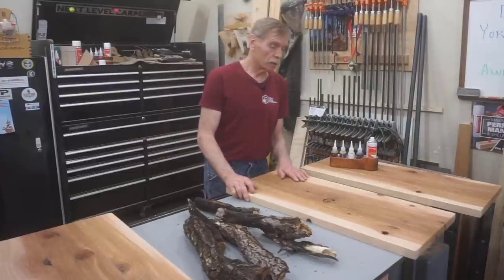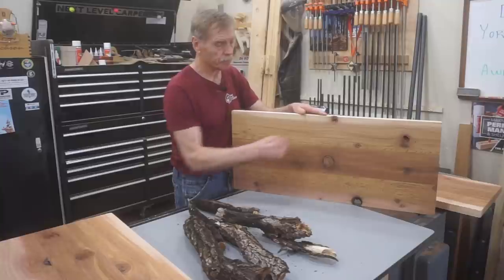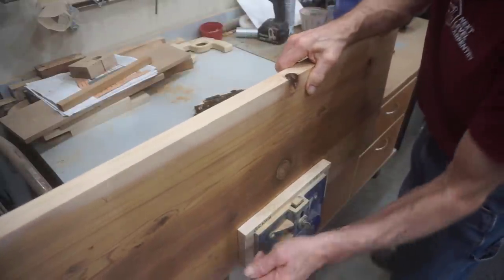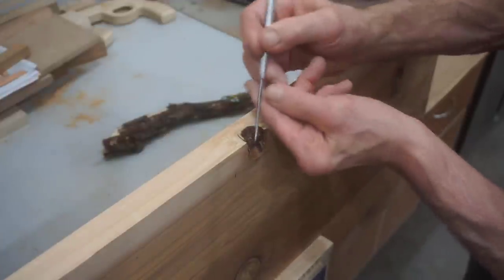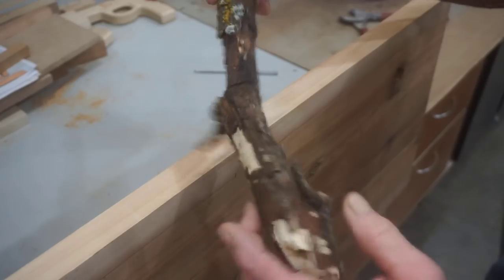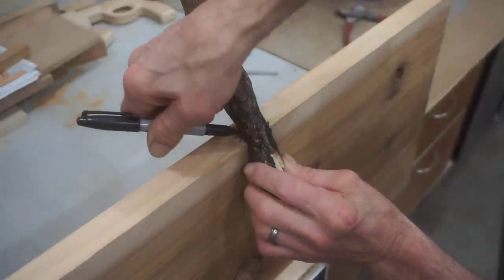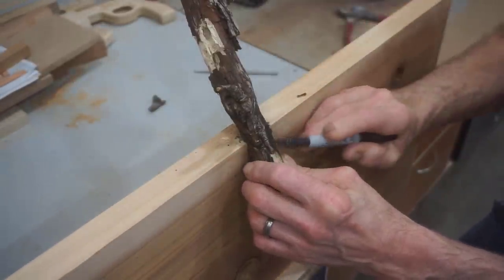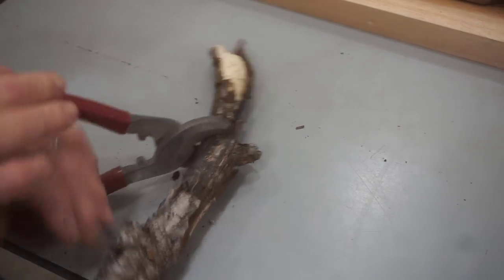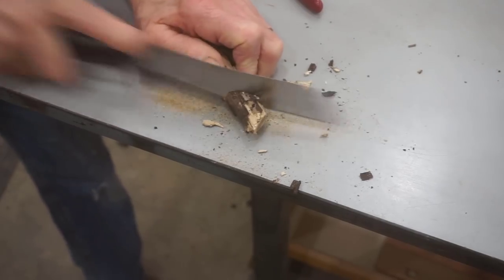With those three key ingredients outlined, I'm going to start with some low-hanging fruit and fix this divot in the corner of this piece. I'll clamp the drawer front in my bench vise so it's secure at a good working height. I use this little angled pick to clean out anything that's loose or unstable. Now that the divot is clean, I'll take one of the smaller branches I got from that old bur oak tree and snip off a section that fits relatively snugly into the spot where a knot used to be.